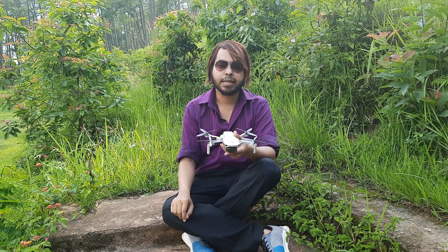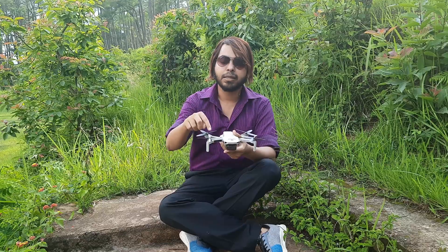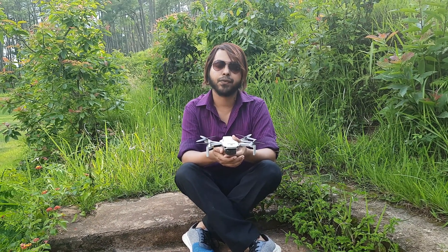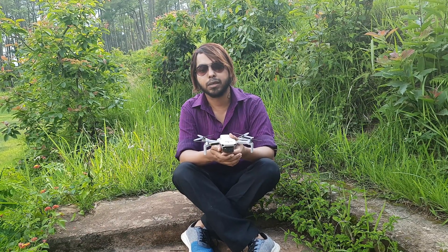I also found out that the overall power consumption is about 15% more with these propellers compared to the stock propellers. I determined this by mounting these propellers onto a load cell apparatus and measuring the moments and forces associated with the propellers.